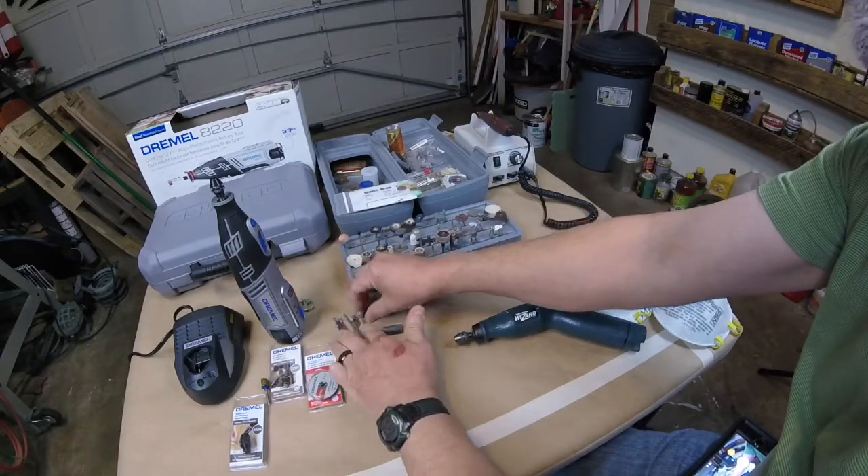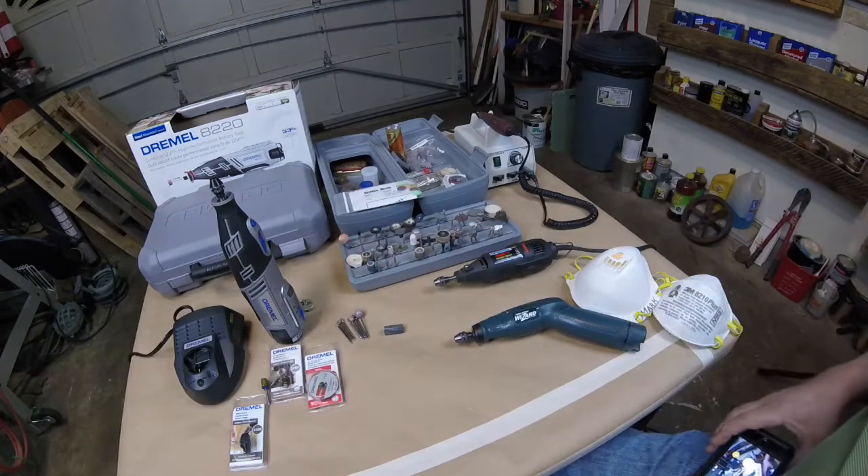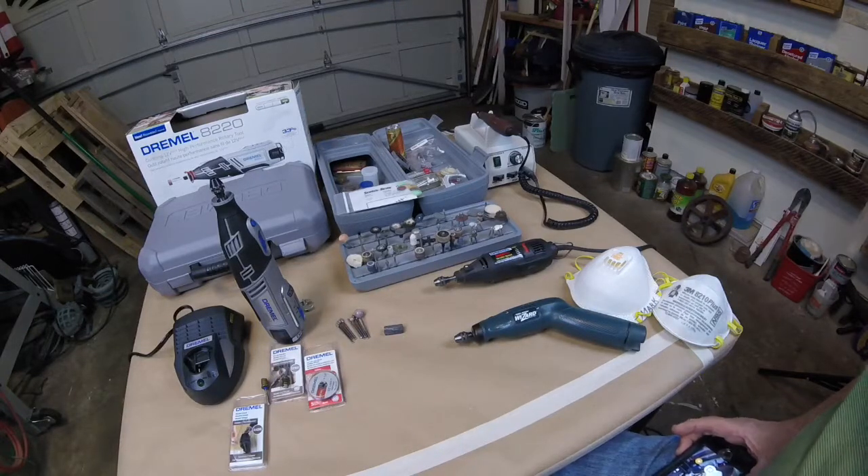The diamond bits you can get very cheap, but the ruby bits are a little bit more expensive. I have a lot of friends that use the diamond bits, and they can really tear into wood — they're very aggressive and they leave it very rough. The ruby bits, when you're done with them, you almost don't have to sand. They're very smooth, less aggressive, which is a good thing especially when you're power carving into something like basswood.